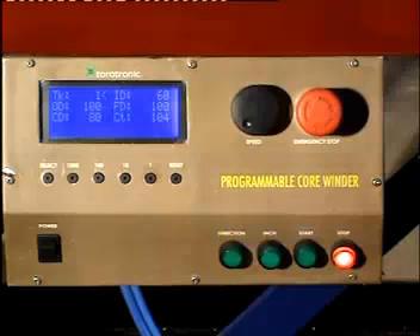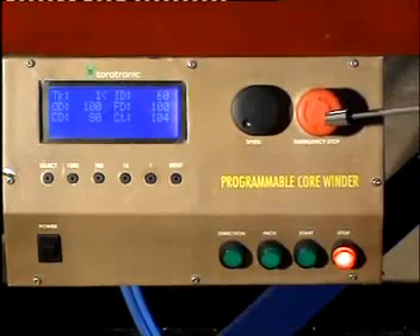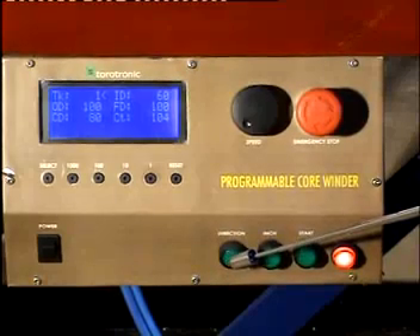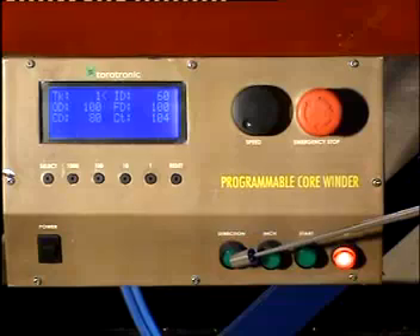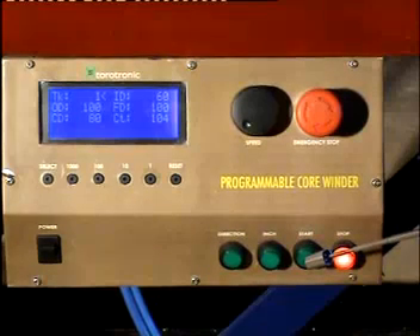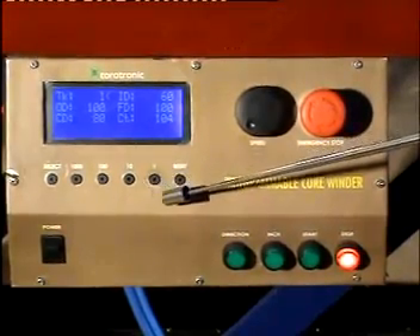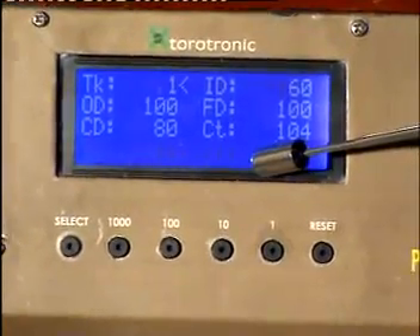The control unit is placed near the operator. This is the power switch to switch it on, and this is the emergency stop button which helps us to stop the machine in case of emergencies. This knob controls the speed of rotation. The first of the four switches is used to select the direction of rotation — normally only one direction is possible, but in case of emergencies we can rotate it in the opposite direction to unwind the core. The second one is for inching operation, the third one is used to start the operation, and the last one is used to stop the machine. Additional switches are used to program according to our requirement, and one is used to reset the whole system. The display used is a blue backlit four-line alphanumeric display, serving as the interface between the operator and the machine.